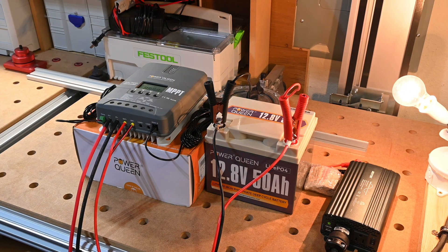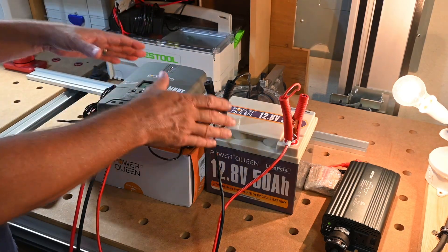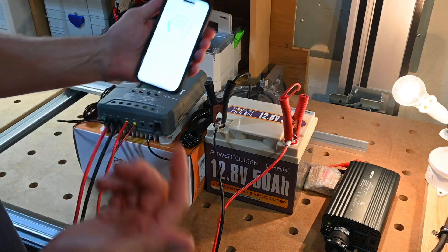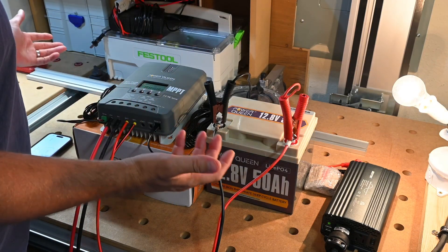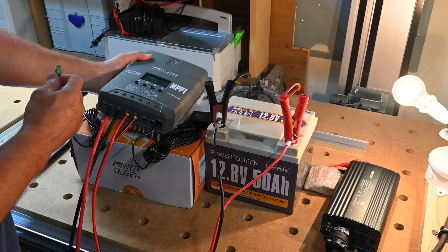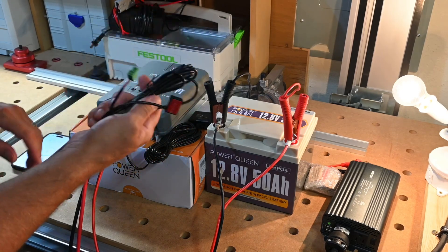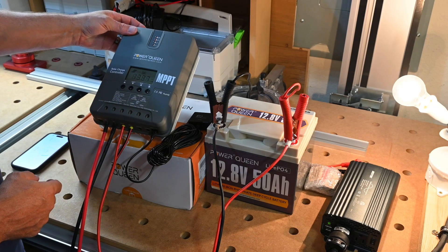So it's doing what it should be doing. I wanted to test this because I have seen some charge controllers where if it gets the battery topped off it kind of just sits there, and when the battery starts to deplete or you're running a load it takes a while to kick in and start charging. This one did it almost immediately — I'm putting in 202 watts. I also need to point out that the temperature sensor is only for lead acid batteries, not intended for low-temp charging protection on lithium iron phosphate batteries, as it clearly states in the directions. But other than that, this 30-amp charge controller is doing a pretty good job.